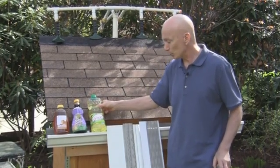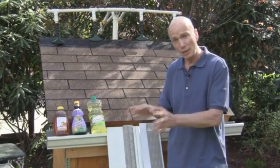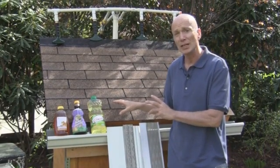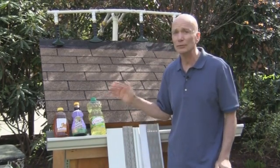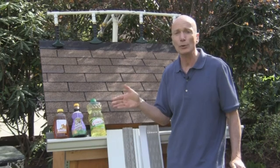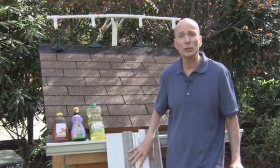So we're going to start by installing these under the shingle. We're going to start with the micromesh family, put each one at a 6/12 pitch. Similar to the water volume test, we're going to put maybe 2 ounces of oil on each product and just count the seconds and see how long a 2 inches or 3 inches per hour rain will take to clean these products of oil.